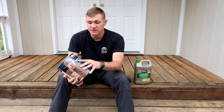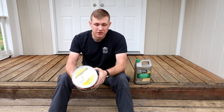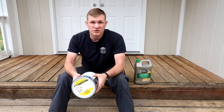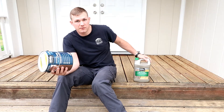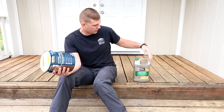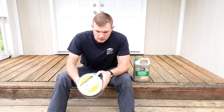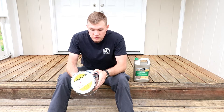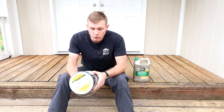The directions for applying the Advanced Deckover start with replacing any rotting or splitting boards — we don't have any of those right now, so we're leaving them in. Next is removing any failing coatings. It recommends either the number 63 or number 64 wood cleaner. This is the number 63, for surfaces without existing paint. If you have additional paint, it recommends the number 64 version, which is a little more expensive — this container was about $10. After cleaning, rinse thoroughly with a garden hose or pressure washer using the broadest spray pattern, keeping the nozzle at least 24 inches from the surface.